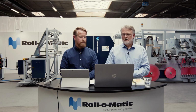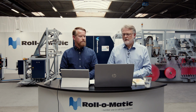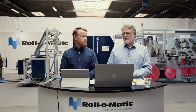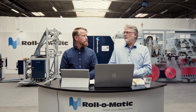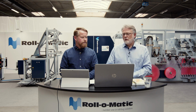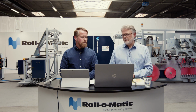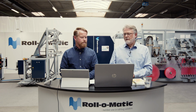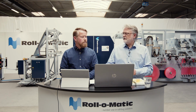The first one here, what are the advantages and disadvantages of interior versus exterior hem? Well, there's not really much difference between running with the hem inside or outside. Our system doesn't open the film completely, so we don't get any air trapped in the web, either if we are running with the hem outside or inside. But it's more customer demand if they want to have the hem outside or inside. But for the production, it doesn't really matter. Okay. But if you have a co-extruded film with a different color on the inside, then you can bend it over and have the contrast color on the outside, which some like the looks of.